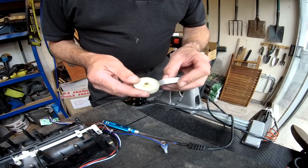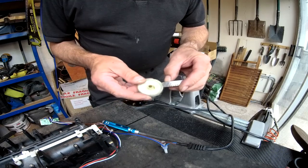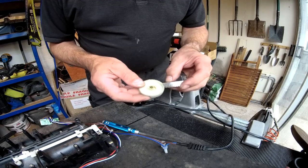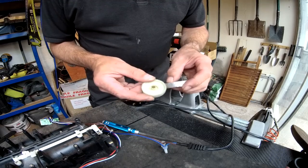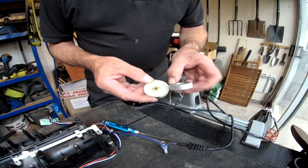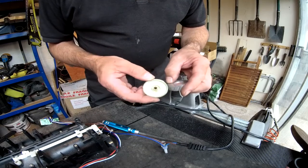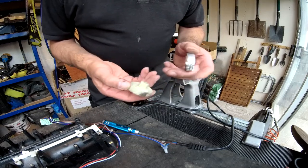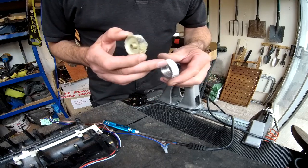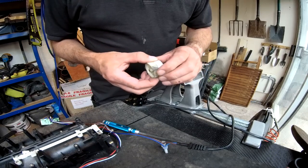I've got one that's a bit big. Another one that's a little bit square. Most of them are pretty good. There's a couple that need a little tweak, but overall I'm quite happy with that. So the next part of the job will be done back in the workshop on the lathe to machine the outer off that. I'll just tweak those last few teeth on there to make them perfect, and then we can get back to sorting out the rest of it.